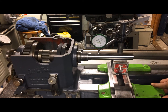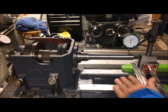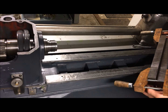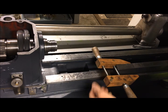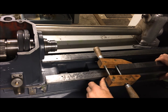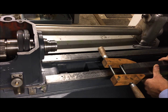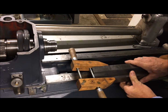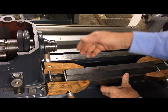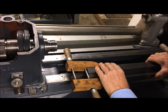I also tested this with the sled for longer support - all this is now flat and I'm ruling bed wear pretty much out of the question. This is my contraption to rule out the possibility of bed wear. I've seated the saddle against the front bedway because I know that is the flattest, unworn section - the other part was a little hollow and needs grinding. Running the indicator on this longer saddle bridges across and evens out any error. It didn't help that much, just a little bit.